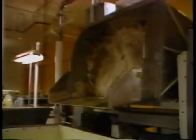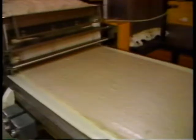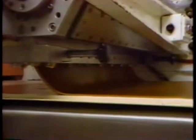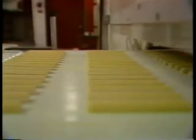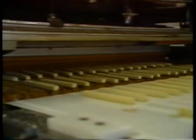Each bar manufactured here has a special setup. This is the malted milk bar line. Caramel goes on top here. Next, the enrober. Controlling the viscosity — gooeyness — of the chocolate at every step is important. This particular mix is adjusted to take a unique swirl pattern from that final roller. Some bars require more steps. This production line is making the snack bar. The very same machinery makes the Mr. Big bar, but even though the steps are similar, slightly different recipes make the two bars unique.